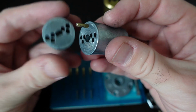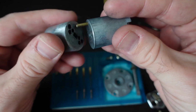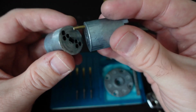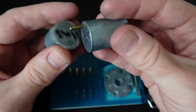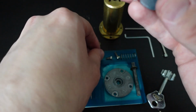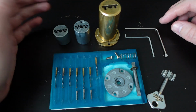But if you pick this lock without the key, of course, and you start turning like this, suddenly at 90 degrees and then later on at 270 degrees of turn, this trap pin will suddenly spring inside of this chamber, right? Because there's only a key pin after you pick it, and then after more turning it goes here, and the trap pin sort of soft breaks the lock, and you either have to release it with some tool, or you have to prevent it from engaging. So that's basically 2 ways to approach this problem.